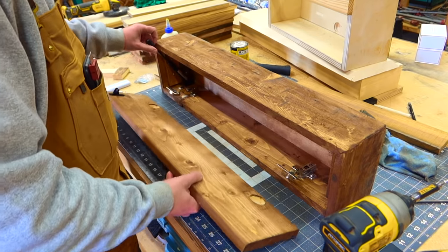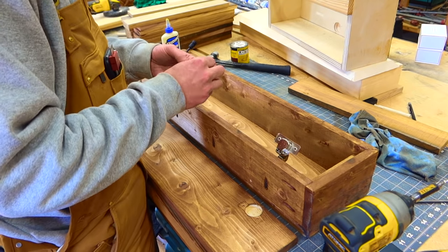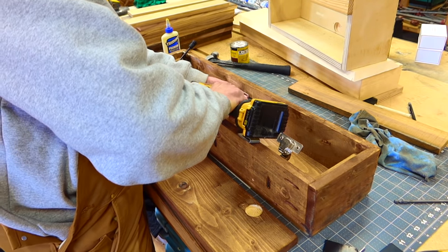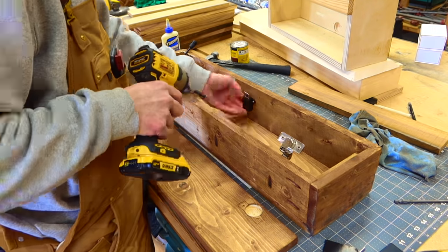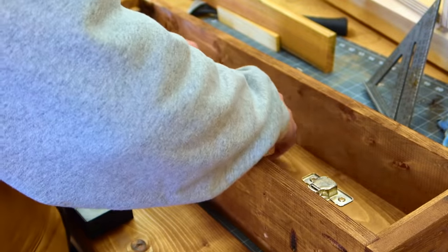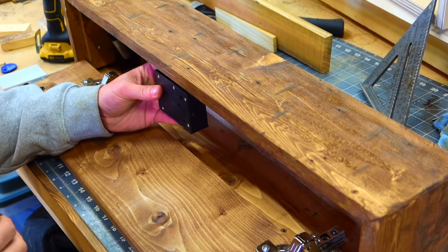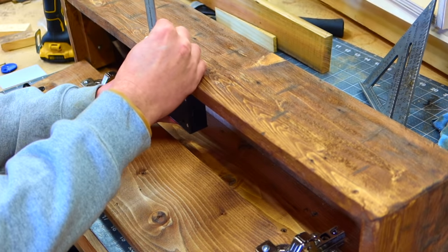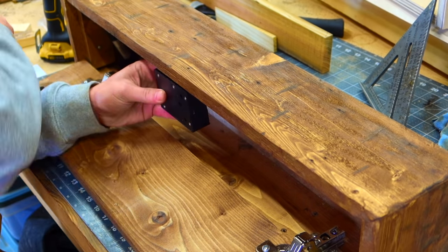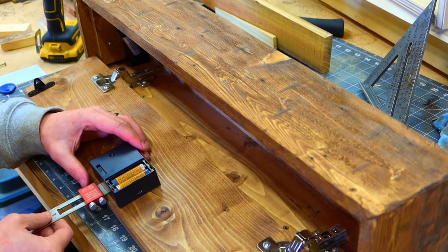To make this install a lot easier, go ahead and undo the hinges from the bottom — take those off and set it aside. Let's get this latch installed into the marks that we made previously. I actually used these motion-activated lights in my last build; they're really cool — they come on at night just to illuminate what you have whenever it's dark, so if you're going to install those, now's a good time. Put the bottom back on, then attach the locking mechanism to the latch. With the latch already installed, I'm measuring down to see the distance between the edge of the board and my lock, so I know exactly where to place the locking mechanism in order for it to mate up with the latch.